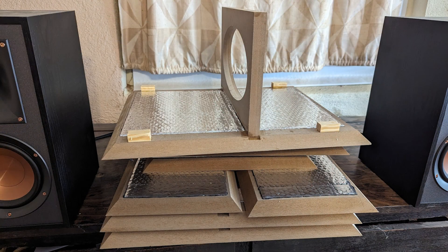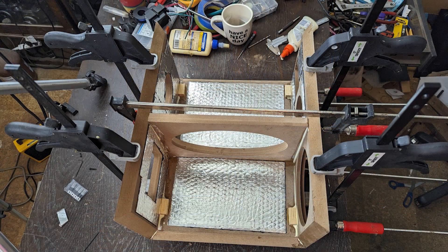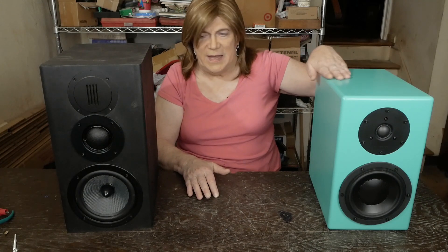On assembling these cases — very similar to the two-way. I put some wood blocks in the corners to support the 45-degree angles while clamping, then clamp it together in sections. I know some people do the masking tape method, but I like doing it with clamps — I feel like I can get better pressure on the wood and make sure they're all squared up. Once you get this first stage glued up, the rest just kind of falls together. I decided to leave square edges on these, where on the other one I rounded it off with about a half-inch round bit.